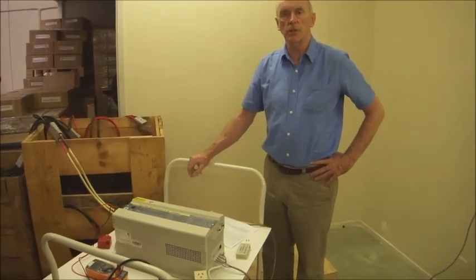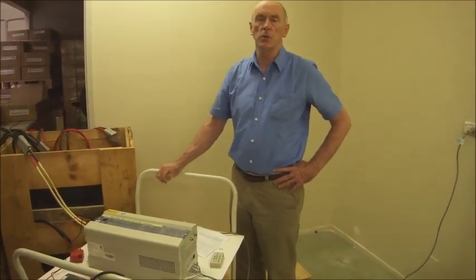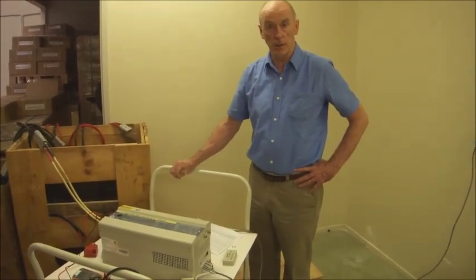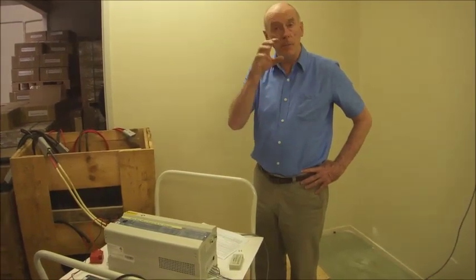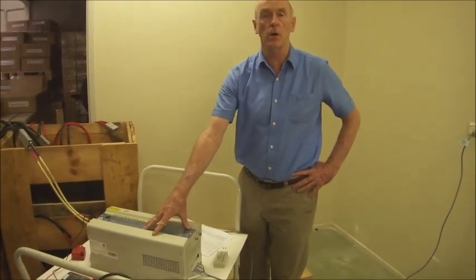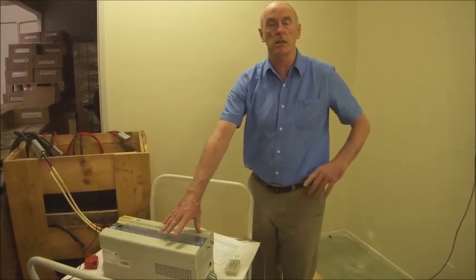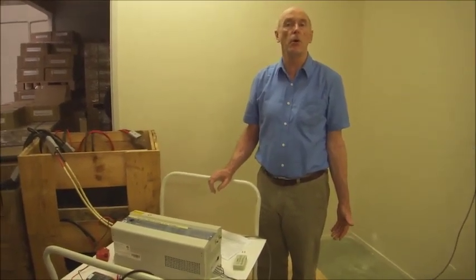With regard to this charger inverter, I'd like to make a very important point: it's a low frequency transformer type inverter. What's the difference between the high frequency and the low frequency type? The low frequency inverter is pure sine wave and works off a 50 cycle frequency. The high frequency inverter chops the DC wave and then builds a sinusoidal wave using high frequency pulses. The main difference is that this has an enormous reserve amount of power — if you're trying to start a motor, this will deliver 3 times rated power for 20 seconds, whereas the high frequency inverter will only deliver maybe 2 times rated power for less than 0.5 of a second.